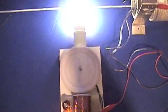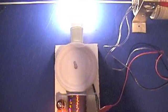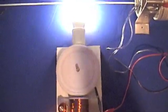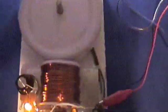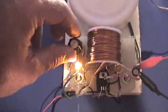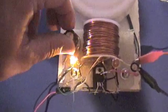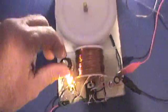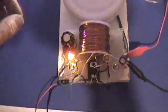All this is is an oscillator — it's basically just cutting the DC into pulses. The wheel going around is for entertainment value; it could be done without, really just done with this transistor here. This varies the distance from 150 down to about 60. I'm lengthening the pulses now — it drives more amperage.